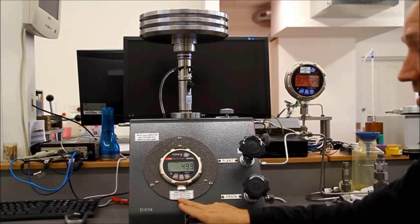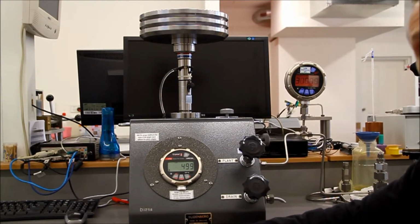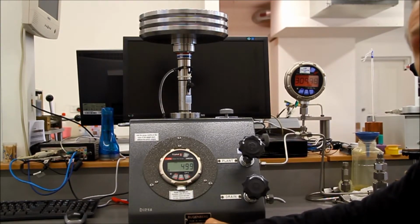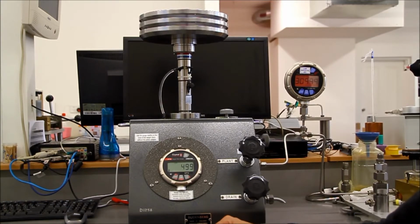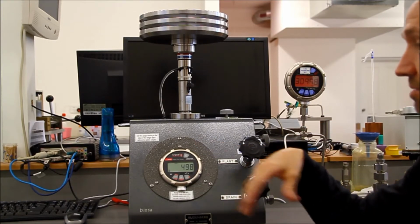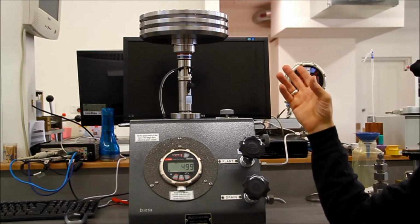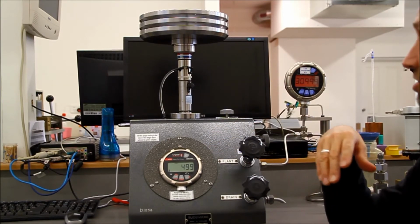We think that the accuracy of this gauge in use is within about tolerance of plus or minus 3.5 kPa, which should offer more accuracy for operation than the previous mechanical pressure gauge, particularly with the ability to zero before use, which is a relevant offset concern for other operations with the mechanical gauge. So perhaps with some temperature measurement of the piston cylinder unit in use, combined with the use of this gauge, it provides a very simple means of measuring pipeline pressure simply, perhaps without the complication of using small trim masses if you were to use a deadweight tester without the use of this gauge on the auxiliary bearing circuit.